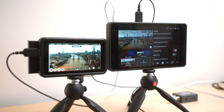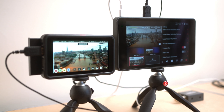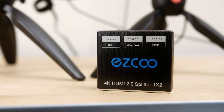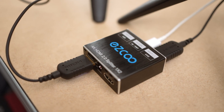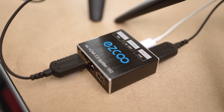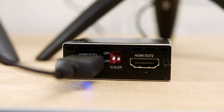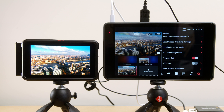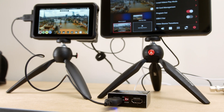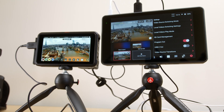Sometimes we're going to need to output the YoloBox's HDMI display to multiple sources. This is the HDMI splitter which I have found works. You need to ensure that when you're using this as an HDMI splitter, the two outputs are set to 1080p mode so it scales it down — it's not technically scaling it down because it's a 1080p signal going out, but you need to tell it it's a 1080p signal in order for it to pass through the data correctly, and then your Atomos device will still receive a full signal with no dropouts.